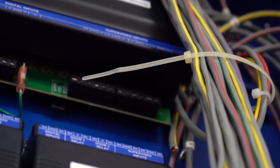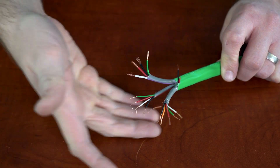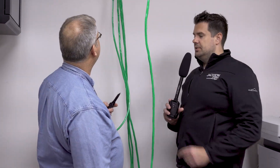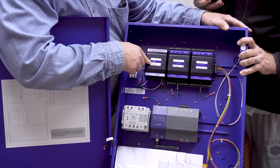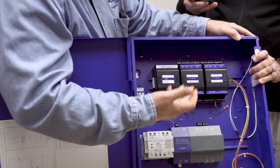What are these cables here? These are actually access control cables. What's kind of cool about these, if anybody has never seen this before, is there are four different cables inside this. We've got one that's shielded — those shielded conductors are for the actual card reader itself. These cables are going to each door in the building. We don't have them all here yet. There are actually nine, maybe ten or eleven doors that we're connecting. What we have here are multiple card reader modules. There's also an I/O module, which we haven't gotten in yet, and you've got some power supplies.